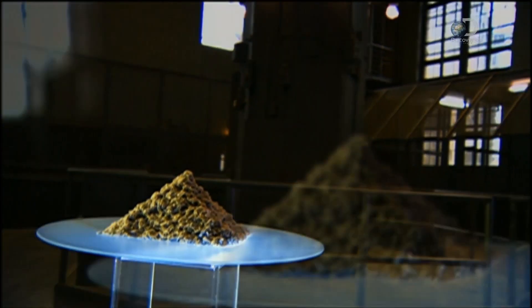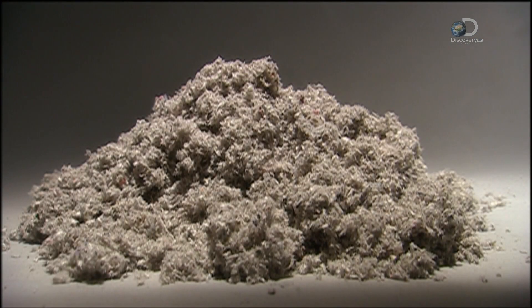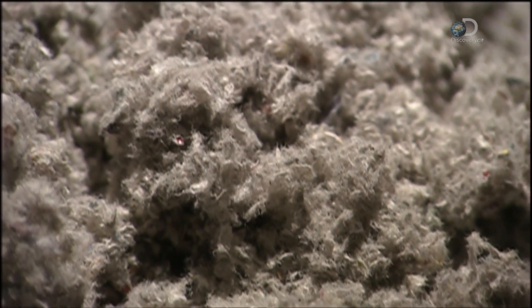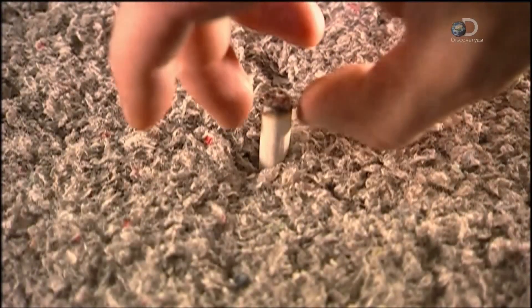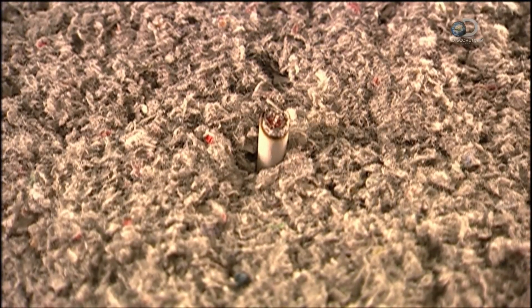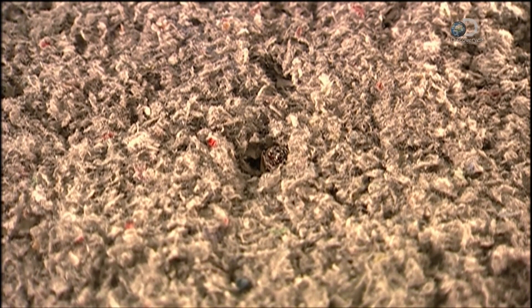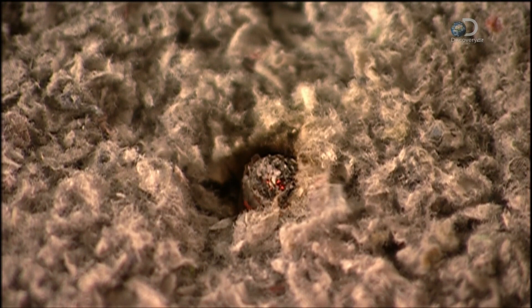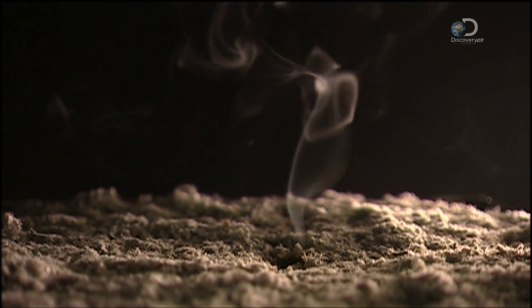Insulation keeps your home warm in the winter and cool in the summer. Like other insulation materials, cellulose fibre has to meet strict government safety standards. One fire safety test assesses smoulder resistance. A sample from the production line is weighed and then a lit cigarette is inserted into it. Once the cigarette burns out, after about an hour, the sample is weighed again. The weight loss must be less than 15%.